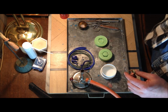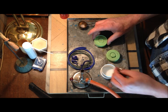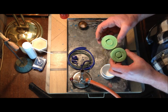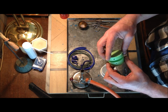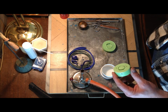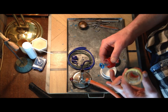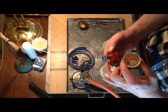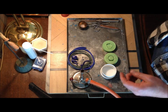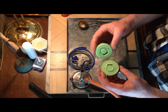You pour half until it's exactly to the middle and let it harden out. What you can also do is put in a couple of pins. Once it's hardened, then you pour in the second half, which covers it completely. And if you've got these two pins you can have a perfect match every time. This is the wax model that I got out of it. What you then do is the exact same thing except for with a round ring — just weld on the two pouring canals.